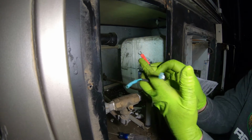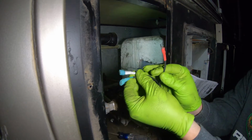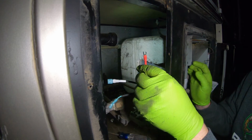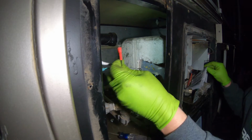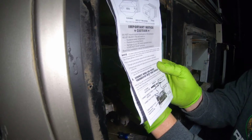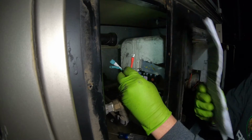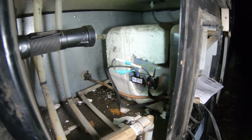You'll notice that 2 connectors have one type and one is the other. The one that has the weird fork-looking end will actually go onto the board, so that's how you know that's where that goes. This particular cord is the plug. According to the handy dandy diagram, the one that goes to the power cord is going to be on the right side, so that's where we will connect it. Alright, so when you're done, it should look something like that.